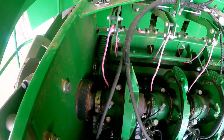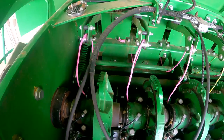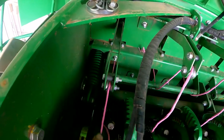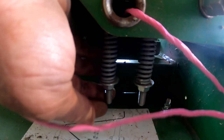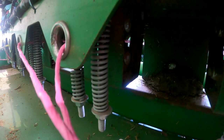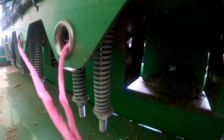One of the things we're going to do on this baler is adjust our upper twine tensioners. The twine runs through what we call the upper slack arm, and the tensioners are on the back side of this shield. These are our twine tensioners — these bolts with these springs. To loosen the twine tension we back those off evenly, and to increase the twine tension we tighten those up evenly. There's a little wheel in there with sort of two gears — the twine goes in between those — and we'll get a better look at those on the bottom side.